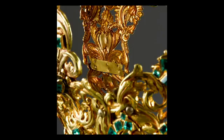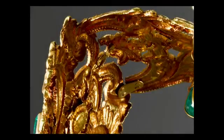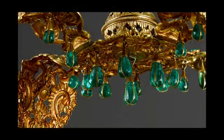Each of the arches contained multiple breaks, which had been repaired in different ways over the centuries, the most fragile of which was this back arch, which had a horizontal break with 3 small brass tab repairs, 2 of which had cracked and were providing no support. This left only 1 small riveted tab holding that arch together at the upper bend. Other breaks had been repaired with silver solder, which created much stiffer areas, which made getting the arches back into shape much more difficult.